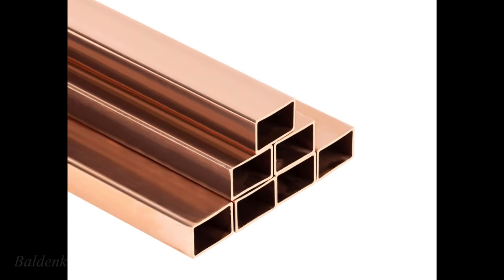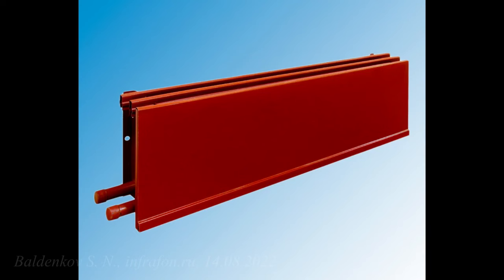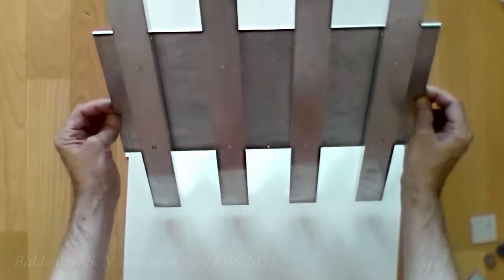The element works very well with iron. It is ideal to make the convector from copper, as it combines the advantages of aluminum and iron: contact resistance is less, heating is fast, and heat release is slow — but the price is high. If you make a convector with ribs inside the body, the heat transfer increases similarly to a water heating convector.